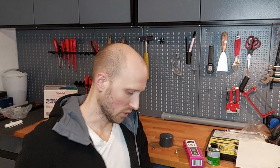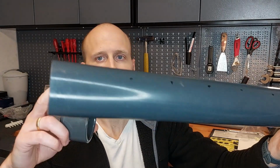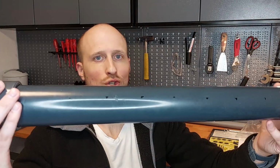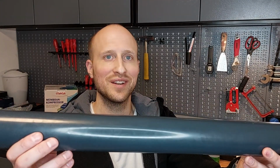And that's it. Finally we have to attach the end caps to the PVC pipe. What we have to do first is to clean the surface with the PVC-U cleaner, and afterwards we can apply the glue on the surface and push the cap onto the pipe. And that's it. We have to do it for both sides. Theoretically it sounds easy. Let's see how it works.